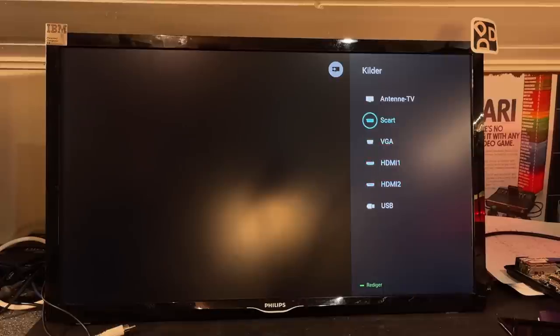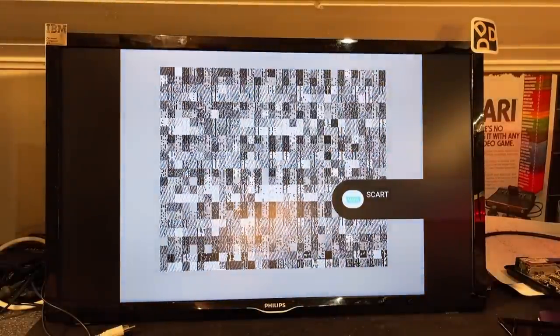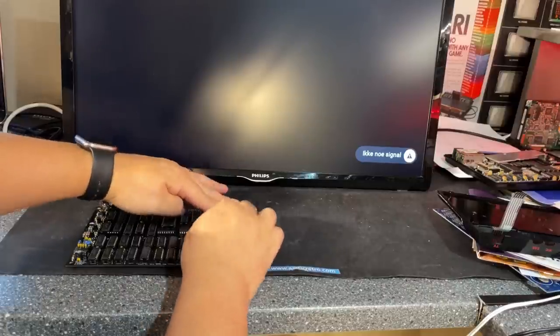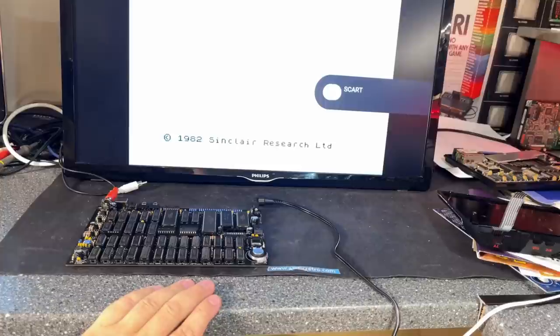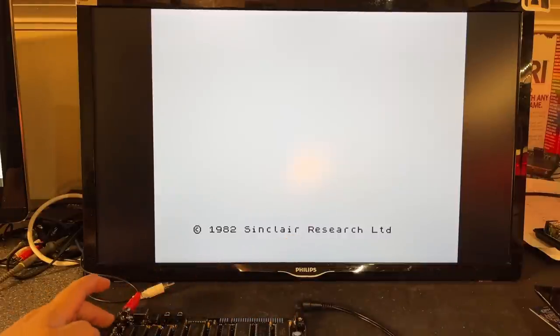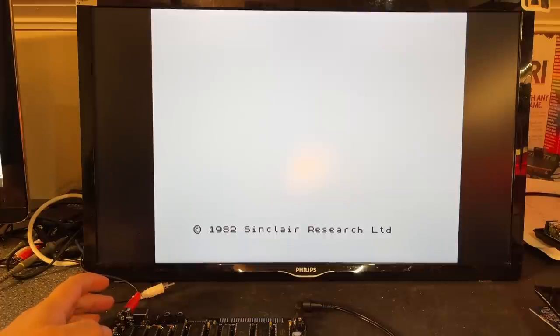It is time to do the first test. Now without the ROM I'm turning on the machine — let's see if we can see anything at all. I just connected the composite out via a SCART plug. Yes, look at that — there is a picture! But no colors. But that is promising. So I'm inserting the ROM now. This is the real test — does it work or does it not? Look at that. Oh my god. It works on the first try! The picture quality looks to be very good — very crisp text even though it's just composite video.